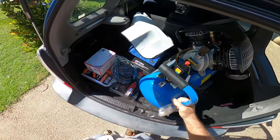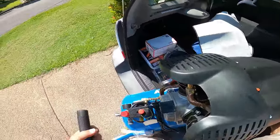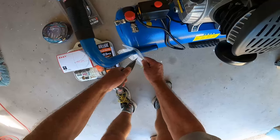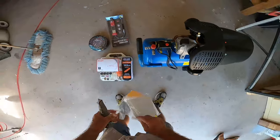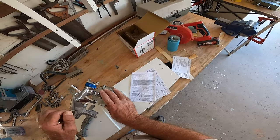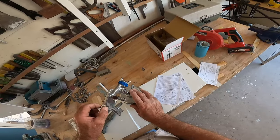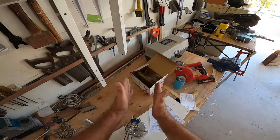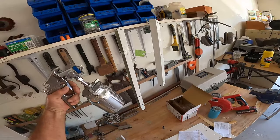I've been experimenting with the roll and tip method of 2-pack polyurethane for quite a while now, and sometimes I've got some reasonable results, but I've found that the variables are too many and too great. So the temperature changes, the wind speed changes, the humidity changes, the product changes, the thinners flashes off and the viscosity changes, and I just haven't been able to get consistent results.